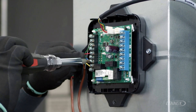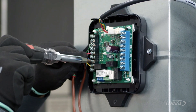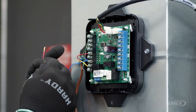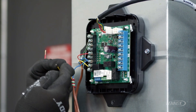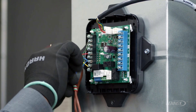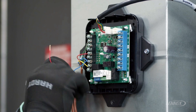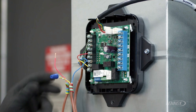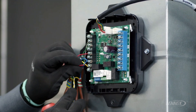The system will have two wires for a single stage unit, which is connected to the common. The system installation will include the condensate safety switch. The condensate safety switch must be wired between the RDS control and either the thermostat or the outdoor unit. In this application, the condensate safety switch is being used to interrupt the Y to the outdoor unit. The condensate safety switch cannot interrupt power to the RDS control.